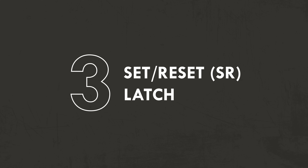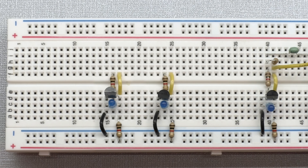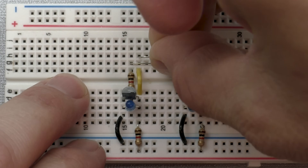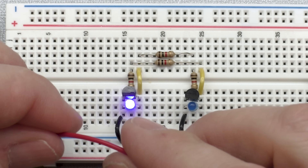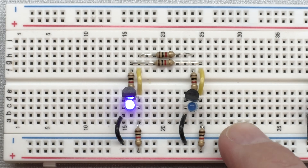Now that we have an oscillating circuit, we need a way to control it. We're going to do that with a toggle circuit known as an SR latch. The really cool thing is this new circuit is very similar to what we've already built. To build our SR latch, we're going to duplicate both inversion circuits over here. Now we're going to connect them together: take a 1K resistor from the output of circuit 2 back to the input of circuit 1, and then the output of circuit 1 to the input of circuit 2. When powered up, one of them is active and the other is not.